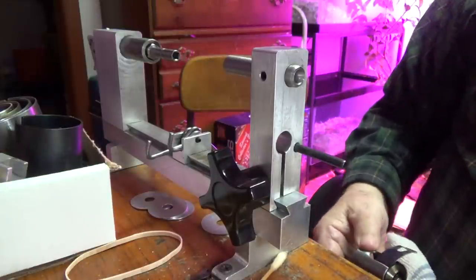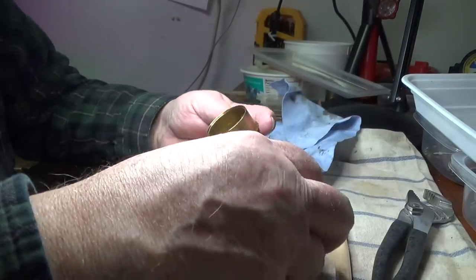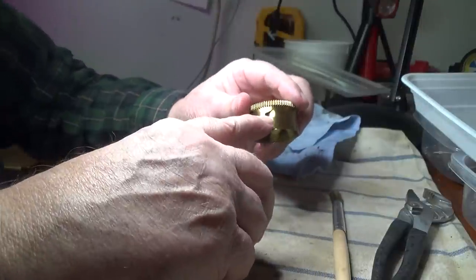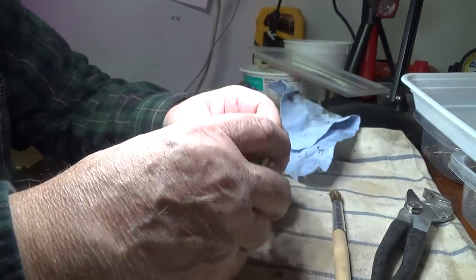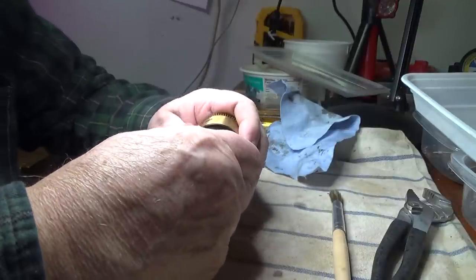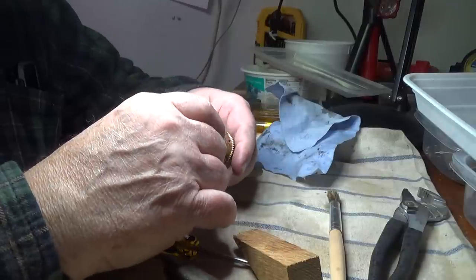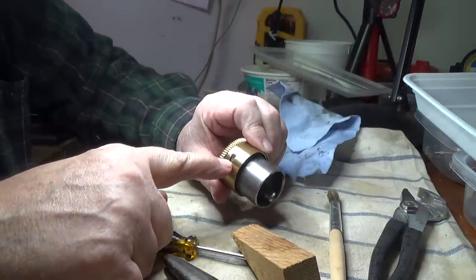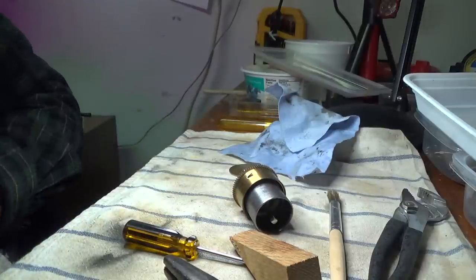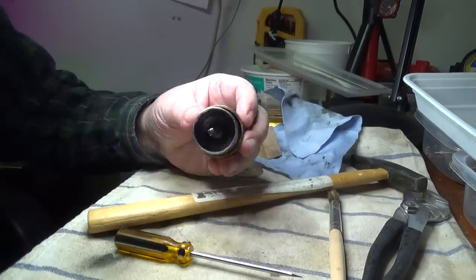Okay, the idea. Alright, now we want to get this back into the barrel. So there's the hook on the barrel, and here's the loop, the hole. It's got to go over that. So we kind of try to line those up. See the edge of the spring on the hole, and now I can put this back in the spring winder and tighten this up until I can pull the retainer out, let the spring back down, and we'll have that spring back in. I'll turn this around again.